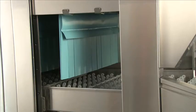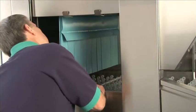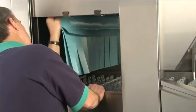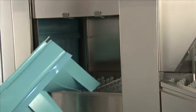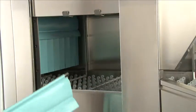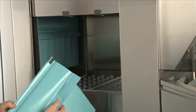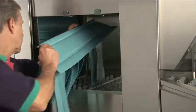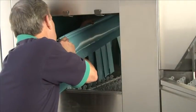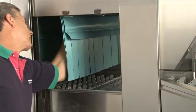We recommend taking the curtains out after each meal period to clean inside the flaps. To do so, after the door is open, simply go in, lift up, and the catches will come clean and pull out to access the curtains. When putting the curtain back in, always make sure the NSF label is facing the load end of the machine. To put back in, line one end of the curtain rod up inside the hook and put the other in its place. The curtain will be secure.